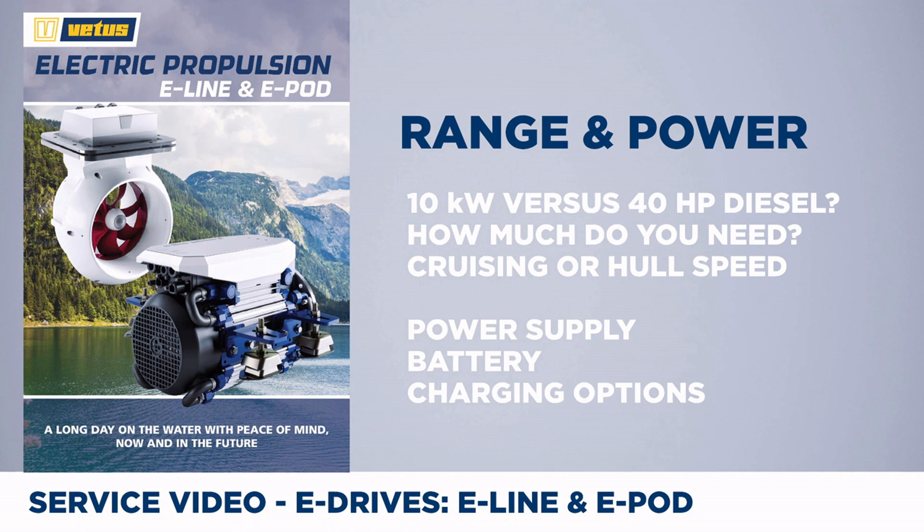When you decide to go electric, you have to make an informed choice about the size of the battery bank and the electric motor. Unfortunately, there are a lot of misunderstandings about replacing diesels with electric drives. Step one is to decide how much power you actually need to get your hull up to hull speed. Especially in Europe, we've gotten used to diesel engines that are way too large for the boat. With a diesel, it doesn't matter much — you just use more diesel and your speed basically won't increase beyond hull speed, because you're transferring all that energy into waves.